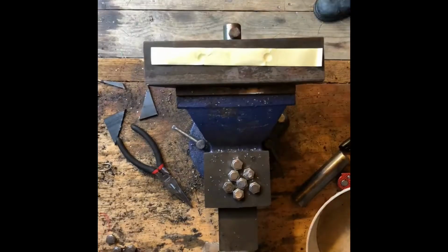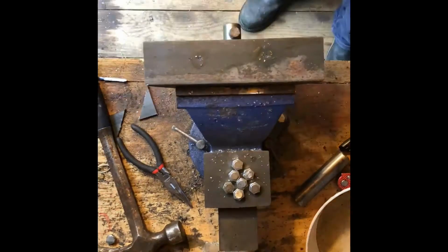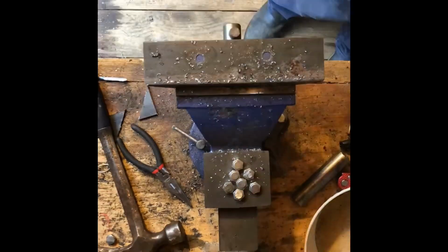I then used a piece of paper to mark out the position of the holes on the lawnmower and then drilled the two holes that will be used to mount the hitch to the lawnmower itself. Because this is a pretty light duty application, I went ahead and installed the hitch using 1/4 bolts and nylock nuts.